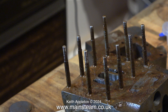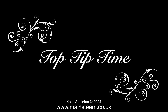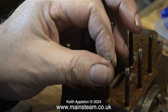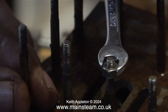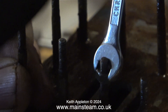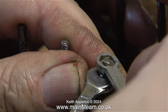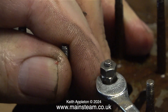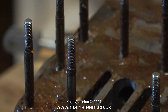What's the best way to extract 10 very small studs? It's top tip time. Thankfully, not all of the studs were tight, but some of them were, and for the tight ones I used the locknut method. First of all, I fit a nut onto the stud in question that is tight. I had to use a spanner to move the nut further down the stud, because I need to fit a locknut on the top part. Here I'm fitting the locknut and tightening it against the original nut. Then all I have to do, using the nut below the top nut, is unspanner the entire assembly, and the stud comes out quite easily.